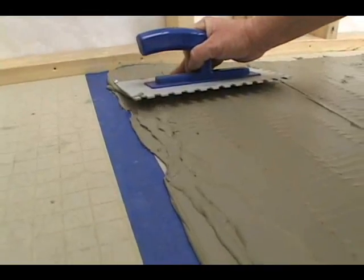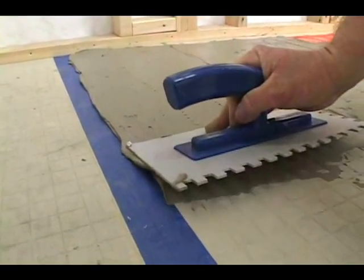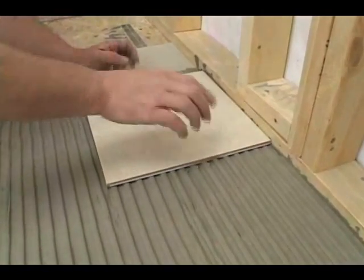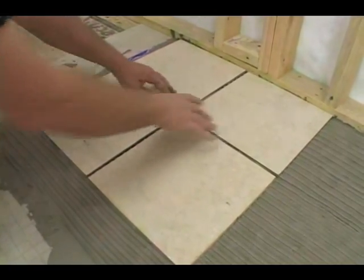When you come to an area where there is no SunTouch mat, hold the trowel at a steeper angle or use the wires to provide a guide to apply a thinset layer. Comb the thinset in straight lines and then apply a covering of tile or stone or other hard surface. Make sure the tile is well bonded to the mortar below.